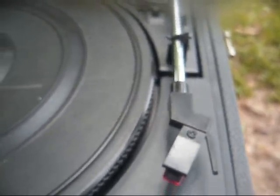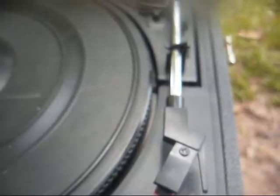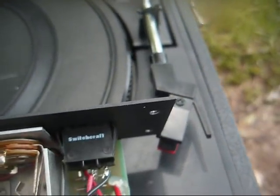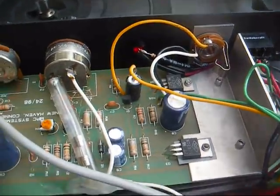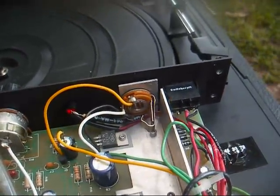On some of the older 70s and 80s solid-state Audiotronics, I've had success with using a lower output cartridge — something in the range of .5 volts. But I had to turn the gain pot all the way up. And I also had to replace a 100-ohm resistor — brown-black-brown — connected to one end of this gain-adjust pot with a 47-ohm or 68-ohm resistor to get even more gain, and then they'll usually sound okay with a lower output cartridge. But yeah, this was just a poorly designed record player all the way around, from the build quality to the choice of amplifier — strictly a case of buying up a bunch of crap and throwing it together and sending it out the back door.